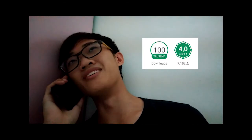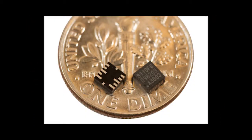No, you can't just bring it to a high place, because it doesn't know how high it actually is. It just measures how long it's in the air. It knows how long it's in the air because it uses a MEMS accelerometer, which is a tiny device that can measure acceleration. To understand how it works, we'll have to talk about two other things first: springs and capacitors.